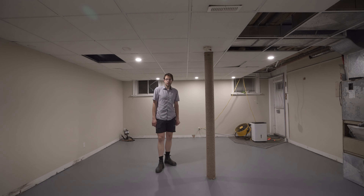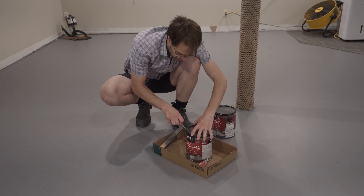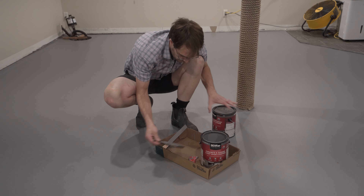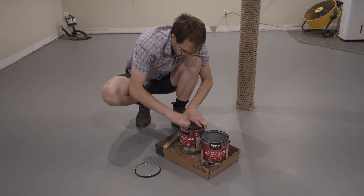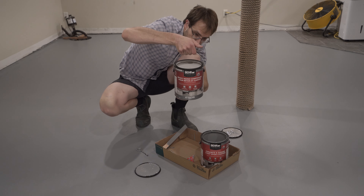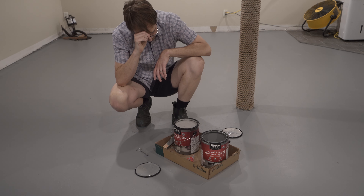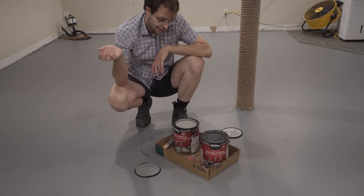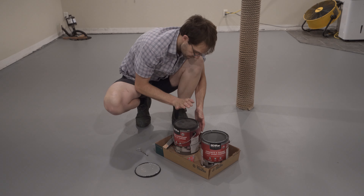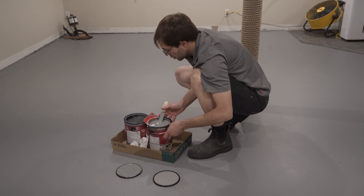Alright, grabbing the second coat — this is the end of the floor, I'm going to cut it in and go the other way this time. First things first, I'm actually going to follow the manufacturer's instructions for once and mix it between cans. Judging by the color at this point it's not a consistent light gray because I've got two different cans here — glad I checked. I can grab another can, probably appropriate. Tip number two: now work with cans of the exact same paint color.